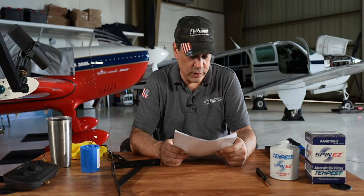This is an exaggerated example of what it should look like: you put the wire through, get way down to the bottom, twist it clockwise, get it nice and tight, and then safety wire up the rest of it. I didn't do that in the video, and it was great that you guys called that out. On safety wire, you can go to AC 43.13 and it gives you everything you need to know about the proper way to do it step by step. It is an important item not to miss.